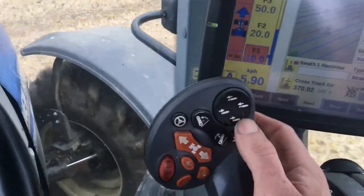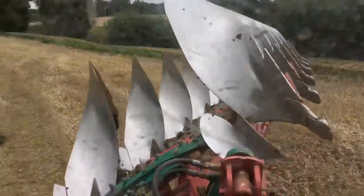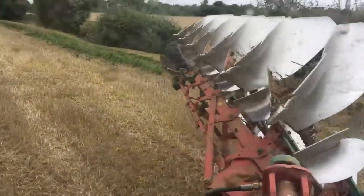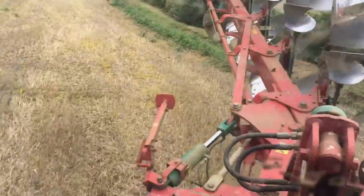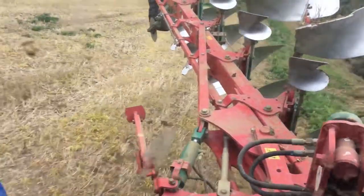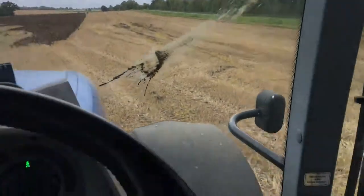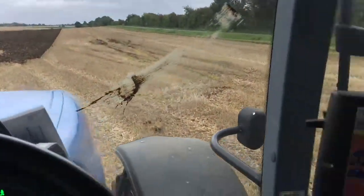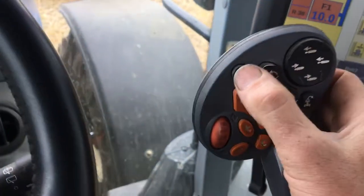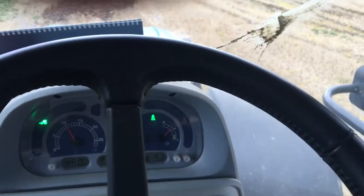Press this button here, which will narrow the plough and turn it over until it's in. The cycle will turn over, and then you should see this little one here. Pull it back out to the 18 inches, exactly where it was — that's pre-set. Then you just go forwards, you can see on the screen, wait until it hits the right red line, the one next to it. Then you engage the steering, and the steering will just take over.